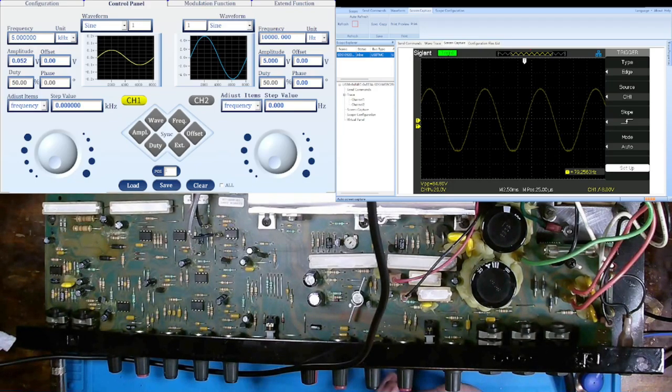All right. For the low, for 80 hertz, we just did the low. For the mid, at 1k hertz, we did the high and the mid pot counterclockwise. And for the high, at 5k hertz, we are only adjusting the high potentiometer counterclockwise. So let's see where this brings us down to.